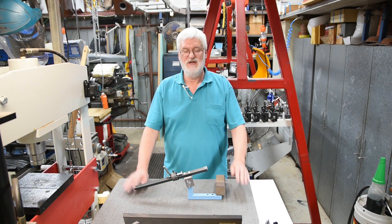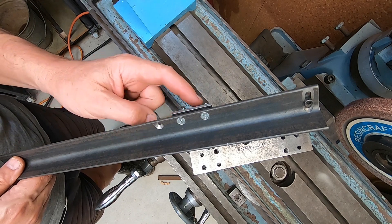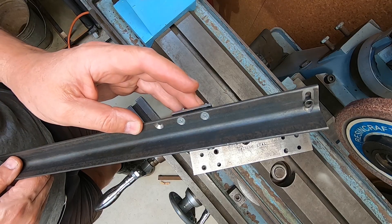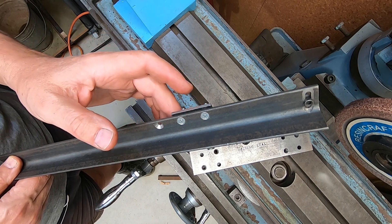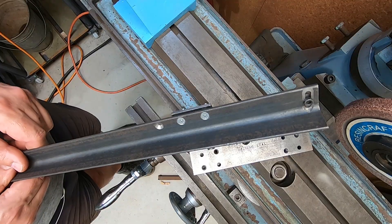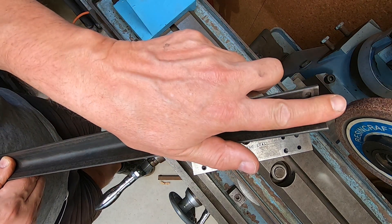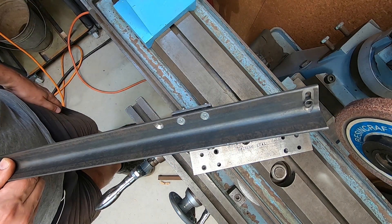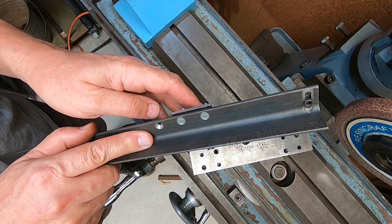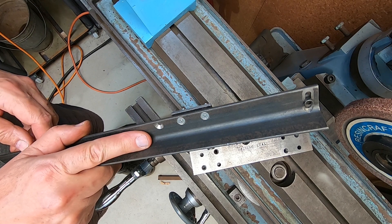One of the issues I have with my lash-up is that the exhaust pipe bracket supporting the column isn't very stiff, and there's also movement with the 45-degree bend piece of flat. You can see it's quite easy to introduce movement at the drill tip, and that's exaggerated further when a drill is fitted. So I want to change the way the drill support channel is supported with a much more rigid column — I've got an idea on how to do that.